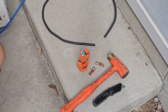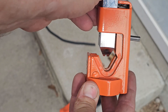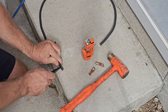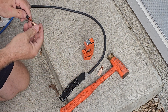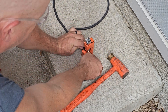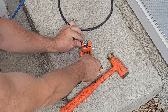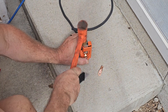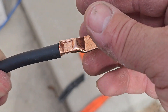I've been busy making battery cables and I've got to say I like this little crimper. You just stick the crimp in there, that comes up, stick it in there, smack it with a hammer, makes a nice crimp on the end. So we'll cut our insulation back, fit the end in there nice and tight, raise that up, slide the connector in. I like to push it together using this hand to pull the wire in and that thumb to push the terminal that way. Then give it a few whacks and you end up with a really nice crimp that ain't going anywhere.